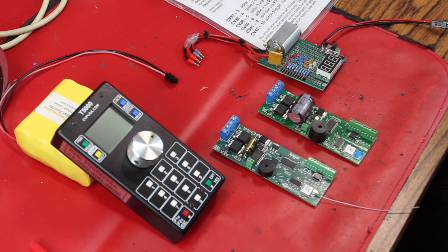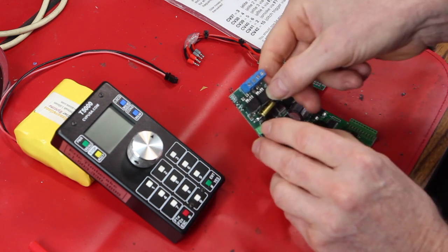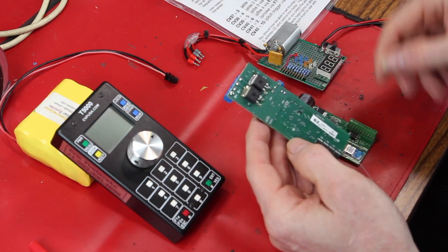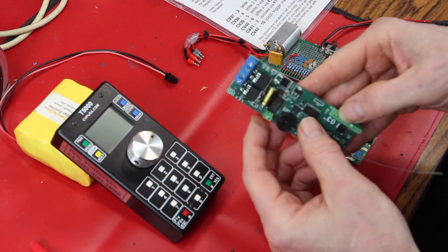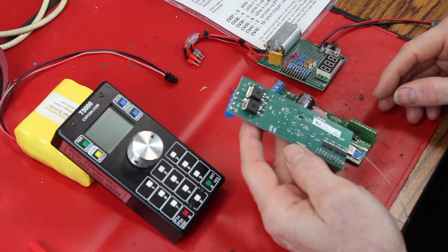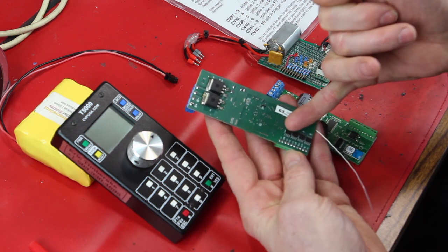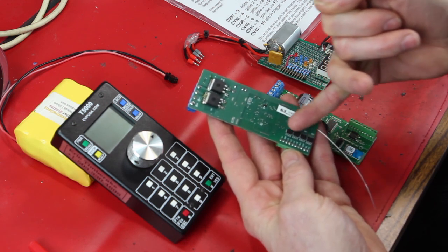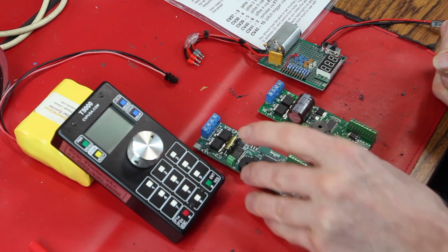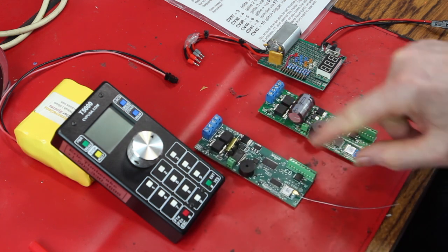And when I fix the first, fixing the H bridge is pretty straightforward, right? It's a couple of big fat MOSFETs. Generally, people put foam on these things or something like that to obscure the heat dissipation qualities, and they burn up. Similarly, the LEDs are driven by these little MOSFET 2-packs stuck on the back of the board. They're all interfaced with this header right here.